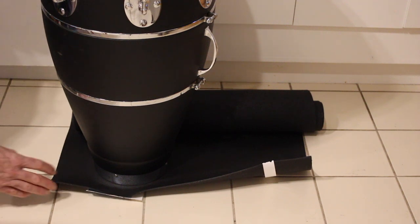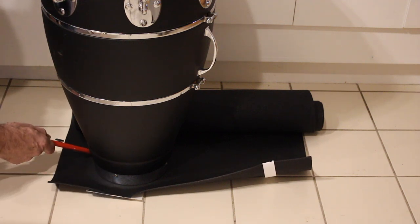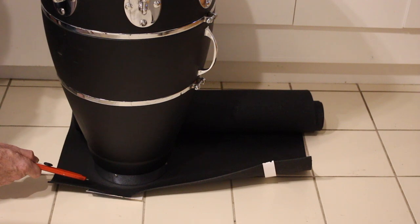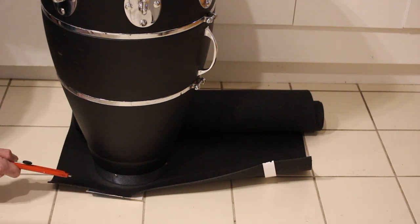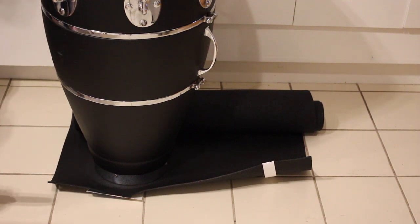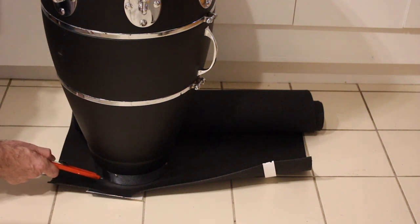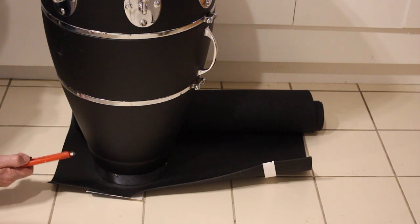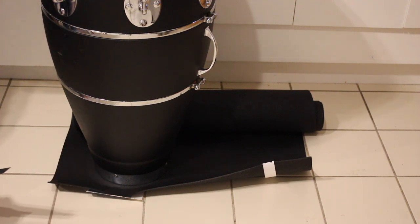So that eighth of an inch is great for this because I might be able to cut one ring and that'll be enough. Or if I have to, I can cut a second one and just add another eighth of an inch. So I can make it as thick as I want with a good adhesive in between the rubber layers. What I'll do is trace out this circle and try cutting it with this box knife blade. We'll see how that goes.